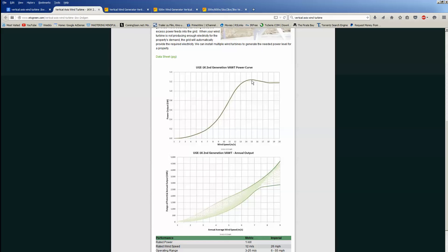That's a very high wind speed. If you look at a normal average speed in your location — say 3 to 5 meters per second on a yearly basis — you'll get about 100 watts on average. That is really low. So I can tell you now: forget expecting serious power at wind speeds of 5 meters per second or less.